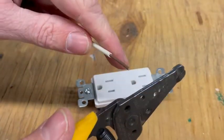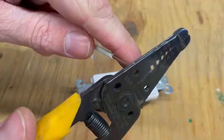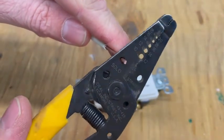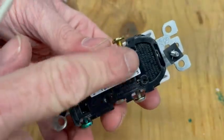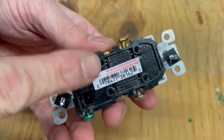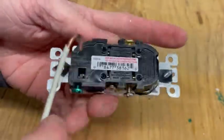Now that we have that stripped, if you look at these wire cutters, they've actually got these two little holes in here. You just stick that wire barely into the hole and then bend the loop. Do not ever use the back stab holes here — they will only accept 14-gauge wire, but don't use them. They are backstabbed; that's a good way for an outlet to burn up.